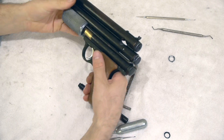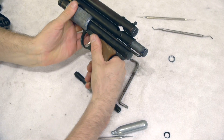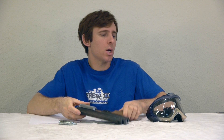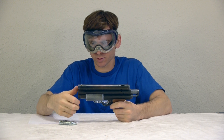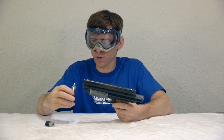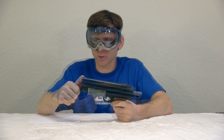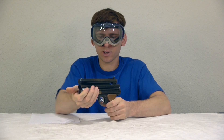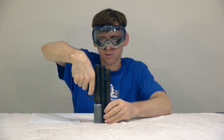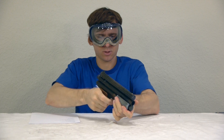We can take our PGP out to the field and it should be working well. Now that we've replaced the seals and the exhaust valve in our Sheridan PGP, we're going to throw a 12-gram in and air it up. Before we do that, let's put on our goggles. Now we'll just take out the front 12-gram plug — I'm just going to unscrew that. Remember that this PGP is shoot-to-pierce, so the 12-gram isn't going to pierce until I cycle it. So now I've screwed in my front 12-gram plug. I'm going to go ahead and pump my PGP, and now when I pull the trigger it's going to be aired out. No leaks. Try it again — it seems like it's cycling fine.